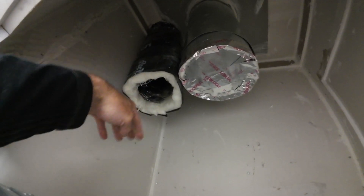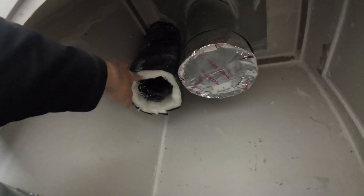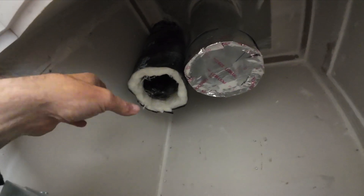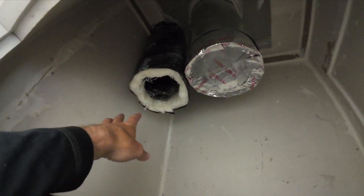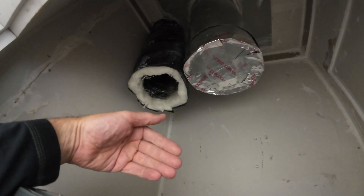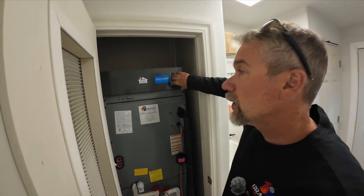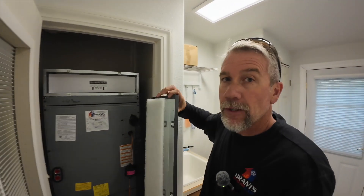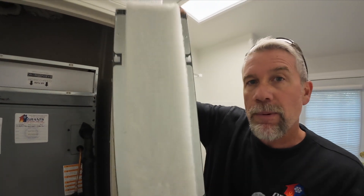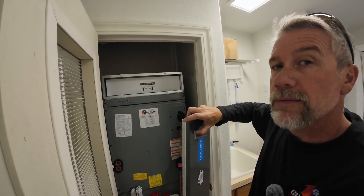This is a fresh air pipe that comes in — some of these have dampers on them — and that was just piped right into the blower compartment. Same difference here; we're just drawing in air, only now it's filtered. In the other system, this was on the back side of the filter, so at least now we have this outdoor air filtered. Easy filter changes on this one — just pull on this handle right here. There's your filter; just slides right out, slides right back in. There's a little fabric soft seal on there to keep a nice seal.